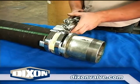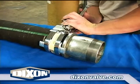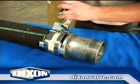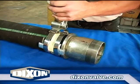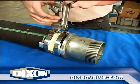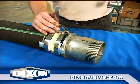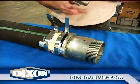The clamp-it buckles must be between the strap grip saddles. With the screw action tool, snug the clamp-it band furthest away from the hose end. Do not tighten excessively, as this may prevent the gripping finger of the strap grip clamp from engaging the stem collar properly. Bend the clamp tail back over the buckle, release the pulling dog lever, and remove the tool.